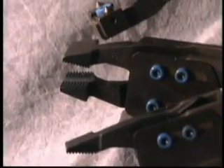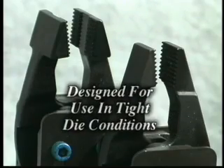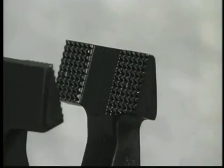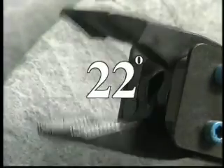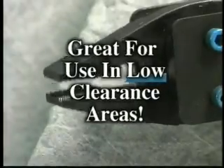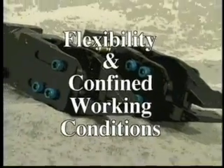In addition to the GRM's six standard jaw types, PHD offers two more specialized jaw configurations as accessories to further tailor the Series GRM to your application conditions. Let's first look at PHD's single needle nose and double hammerhead style jaws. If the die conditions you're working around are very tight, these jaw styles might be just the ticket for you. The tip of these jaws incorporate diamond gripping teeth on both jaws A and B, ensuring a stable grip. The jaw rotation for the needle nose and hammerhead jaws are 22 degrees for both jaw A and B, specifically designed for working in low clearance areas. Flexibility in confined working areas are these jaw styles' niche.